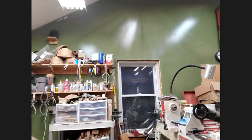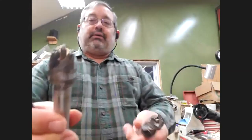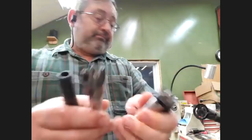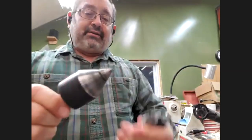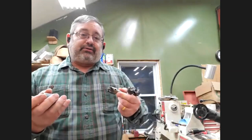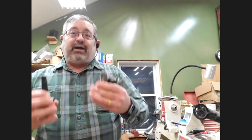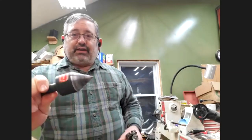The first are basically the drive centers — these all come with your lathe, everyone's seen those. And the live center on the tailstock which spins. These are mostly for spindle turning, though a lot of people start bowls between centers so they can balance the grain out how they want. These usually come with every lathe, so usually the live center you get is pretty cheap.